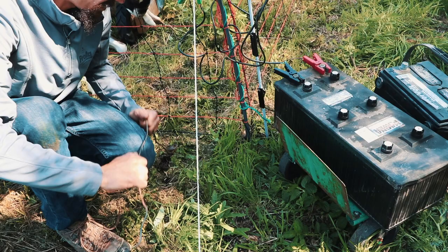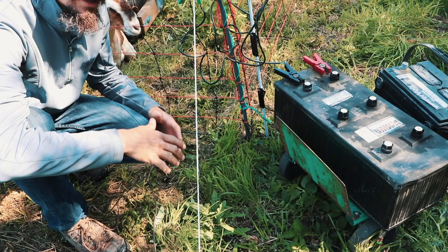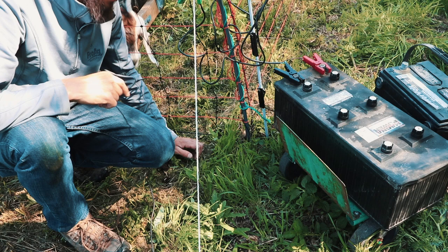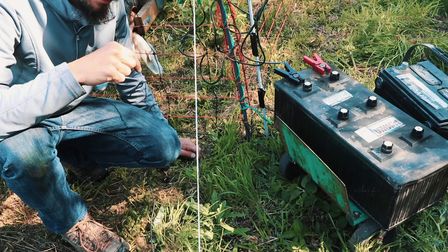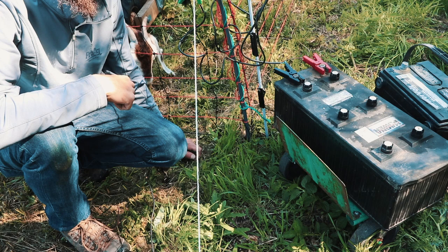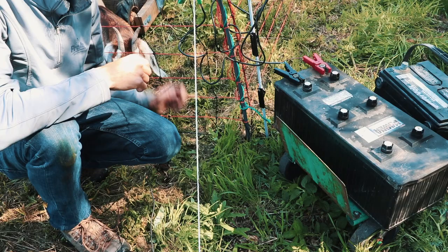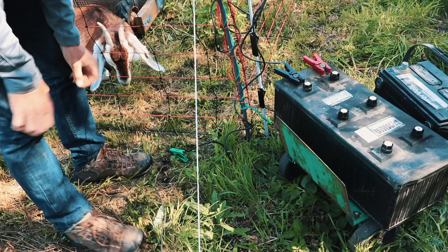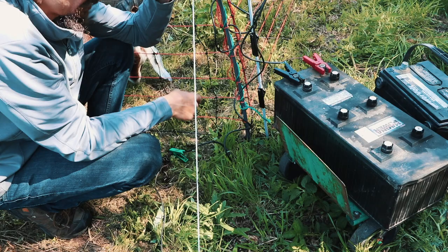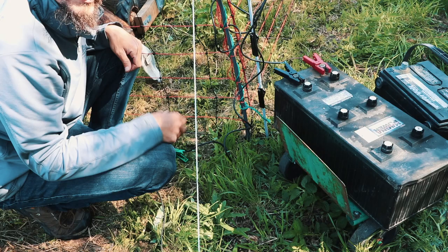What I'll do is keep putting more copper wire in the ground. I might even get to the point where I have to drill holes — I've had to do that before, where I can't just push it down anymore because the soil doesn't have the moisture it has in spring. When you get into July and August, I've got a huge auger drill bit and I have to dig way into the ground and just start filling that with copper wire until I know I have an adequate ground. That is how important getting a good ground is — it's going to make everything work for you. You might end up needing multiple metal stakes in the ground, whatever you have available.